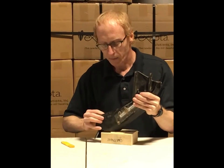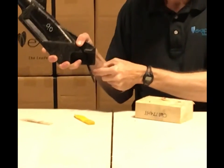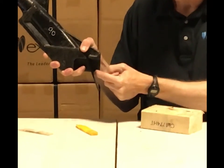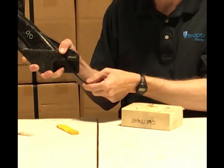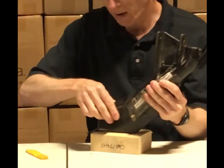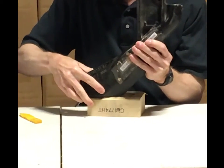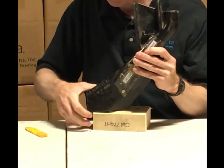As you can see, unlike the Deere flap, ours starts angled down very, very far ahead of this rear corner, so even as it drags a little bit along the bottom of the furrow, there's still no gap here at all. It might be dragging up like this, but there's no gap there for seeds to escape.